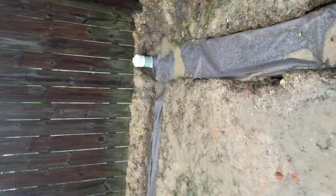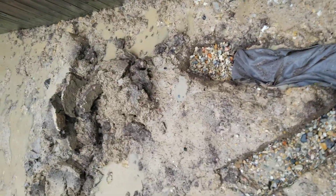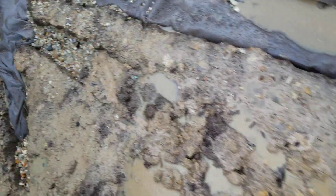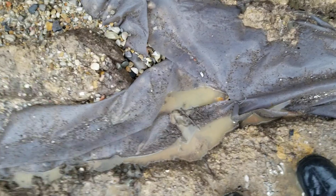Obviously you've got to put siding in here, not done yet. Clean-out right here, 90-degree elbow, along the fence. We stop here — got a Y connector, French drain right there, and a gutter downspout next to this 9-inch catch basin right here that runs right here. I have a cap on the end of that with a bunch of holes drilled in it, and that drains right into here with a bunch of stone. I didn't put a pop-up because I don't want to go against gravity, so it just empties out into the gravel on the outside of the fabric.